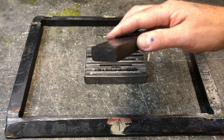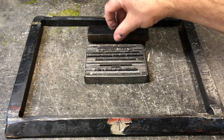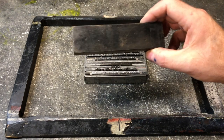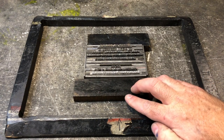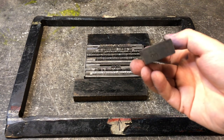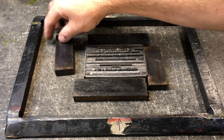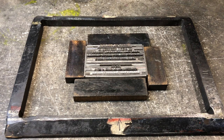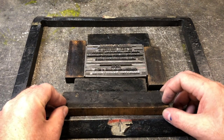Now reaching up I collect some furniture — we'll talk more about that towards the end of the video. Furniture are chunks of wood, different thicknesses, different lengths. Thicknesses are obvious; the lengths are stamped on the end. In this case these are 30 pica lengths. You'll notice that I'm placing one at the top of the form and one at the bottom, slightly out of sync with one another, slightly skewed, and I'll do the same on the side. I don't want the pieces of wood touching one another. I begin from around the lead type form, moving out with increasingly long pieces of furniture. This is a personal preference — I like it for stability.